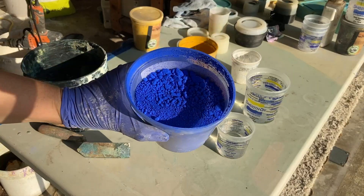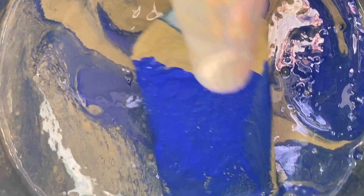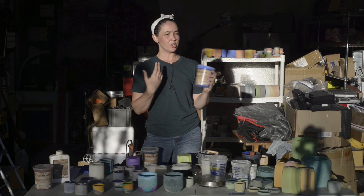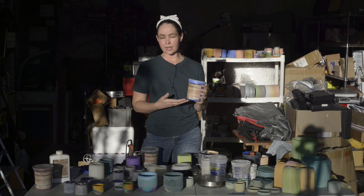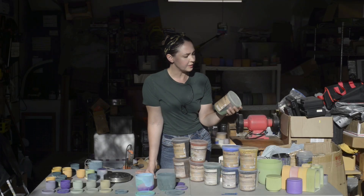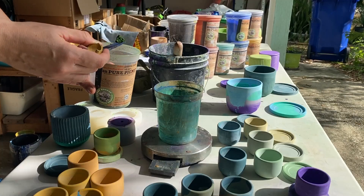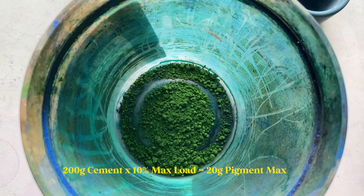So what are pigments? Pigments are powders or liquids that are added to your concrete mix to achieve different colors. When it comes to concrete pigments, there are three main types: there are the natural mineral ones — for example, micas or cobalts — then there are the oxides, which are the most popular ones and the easiest to work with, and then we have synthetic pigments. When working with pigments, the one thing you want to take note of is the max loading rate, which for this pigment is 10%, meaning 10% of the cement weight. My concrete mix contains 200 grams of white Portland cement, which means I can use up to 20 grams of pigment without running into any issues.